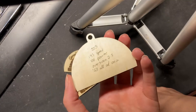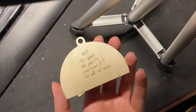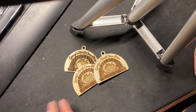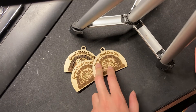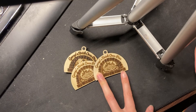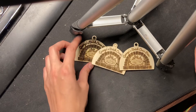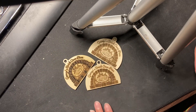When I do the larger pizza peel with a 10-inch version of this, it only took five minutes, which was great. I also did another one which is pretty much the exact same thing with the same over scan — I was just curious to see what 100% power would look like instead of 90%. For this, I don't think there was a noticeable difference. If I wanted it darker, I would probably slow it down to like 120 or 130 millimeters per second. I just wanted to talk about those settings because I thought they might be helpful to somebody. Hopefully that made sense and good luck on your laser cutting journeys!